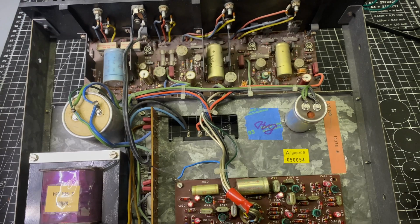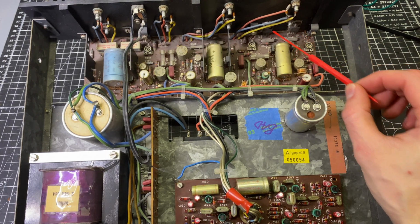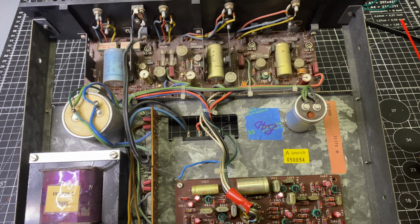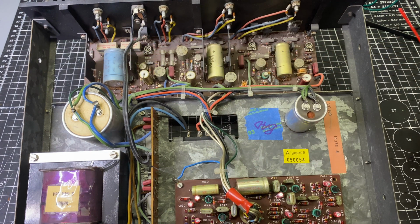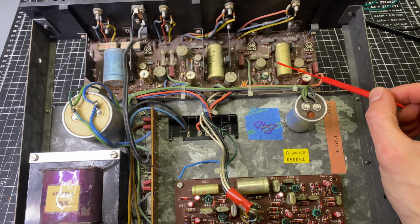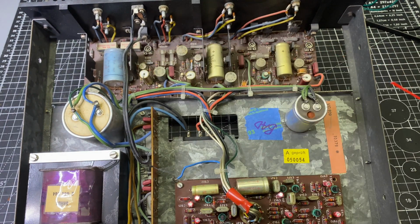And you'll notice that in the tweeter section, the transistors are these little guys here, where we have actual big TO3 package transistors for the mid-range and the bass. These are the coupling capacitors, and the frequency is specifically chosen for the bandwidth of that specific amplifier. So these ones are each 1,000 microfarad, I believe, is what the schematic said, and then this one is quite a bit larger for the bass.